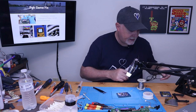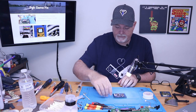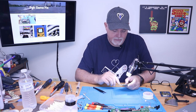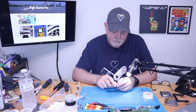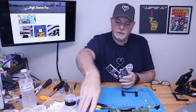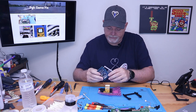Okay. That's what the modification to this board requires. So the diode, if we'd have left it in line, has about a volt to a volt and a half power drop. So we bypass that to get more power in, since we're on batteries, and then just feeding the regulator direct helps. So now, since we have this all soldered up, we can put our screen back on.